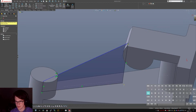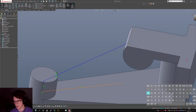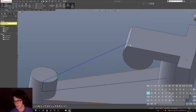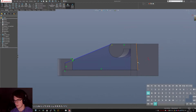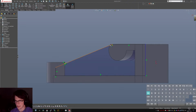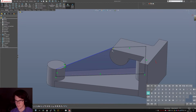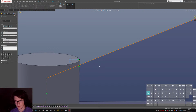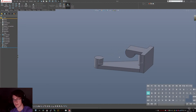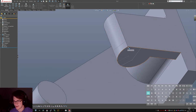We'll do that pierce. And I'm actually going to get rid of this one. This guy's going to get extra long to reach out. And there we go, vertical. I'm not really working normal to the plane here. Oh, that's a lot easier. Vertical. Oh, I didn't do it coincident to the point, which is where I want it. Coincident to the point. And then I can give myself a separation here of 3 millimeters, which is as close to accurate as it's going to get in this part, because this is just a garbage drawing. If someone handed this to you in an exam and said, draw this part, you have 30 minutes, nobody would get it right. It's just really crap.